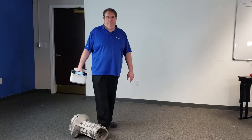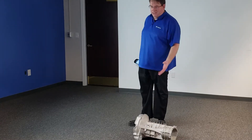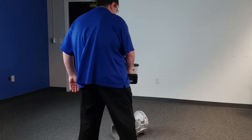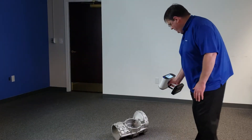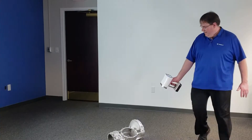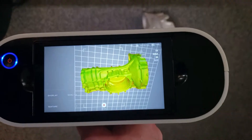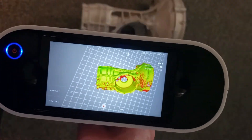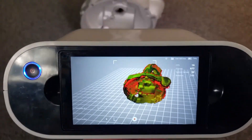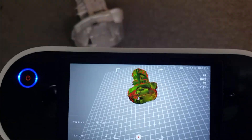Artec LEO — it doesn't matter. You can move it wherever you want, because it uses the object to target. We're going through to regain the scan geometry. So once I re-aim it, point and shoot, just the same way, I can start scanning again. It gives me active feedback — as it turns green it has the data, and the redder spots are areas I've missed. For example, I can get down in the bell housing that I missed earlier, giving you the flexibility to easily scan your object.